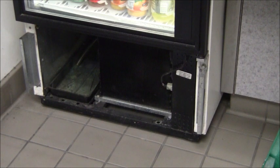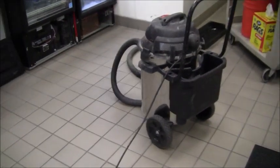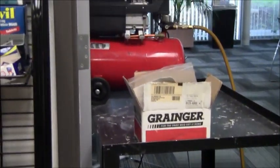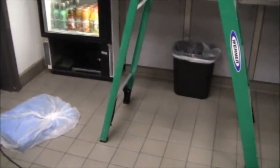I just shut the compressor off for a second — you know what, I think I got about 95% with just the vacuum. That's great if you don't have compressed air and all you have is a shop vac like this one. You can do a really fine job just with that, but with the combination of the shop vac and the air compressor, the combination really gives you superior results. I'm going to continue to vacuum out the rest of these coils and blow everything out.